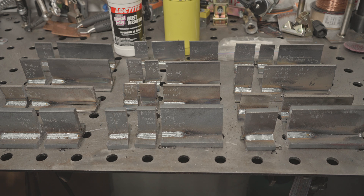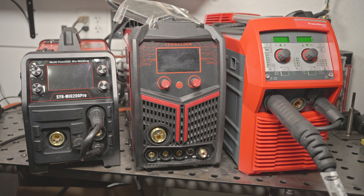In the end, I would say the Fronius and the Hitbox both have more realistic auto settings than the Yes Welder, as well as more power overall. The Yes Welder's auto settings are woefully cold, and even cranked up, it just didn't burn in as well as the others. The Hitbox has some quirks with the auto settings, but with 0.030 wire on 1/8 and 3/16 inch steel the auto settings were usable, and I was able to get decent results on 1/4 and 3/8 inch with manual settings. The Fronius did run strange for that first bead on 1/8 inch, but after that, both 1/8 and 3/16 burned in great on auto settings, and 1/4 and 3/8 inch were no problem with manual settings. All three of these machines are dual voltage, and I will do more with these welders including testing actual output, power draw, power factor, and testing all of them on 120 volts.